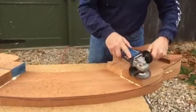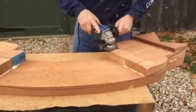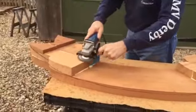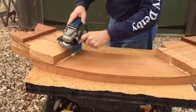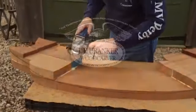I will be leaving some wood so as to have some wiggle room as I near the completion of the carving. The top, or the ends of the banner, will remain thicker at the same time. This will allow me to have a thicker, more stable area when I flip the carving over and start working on the front side.